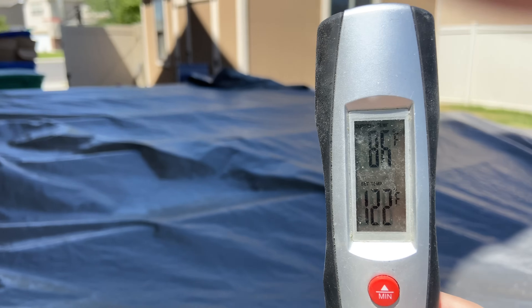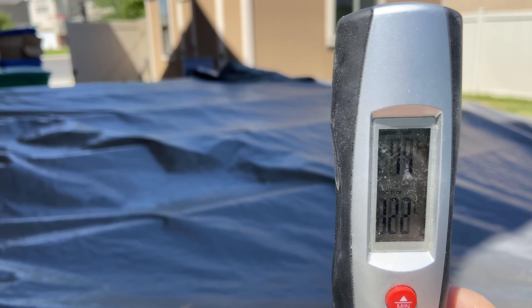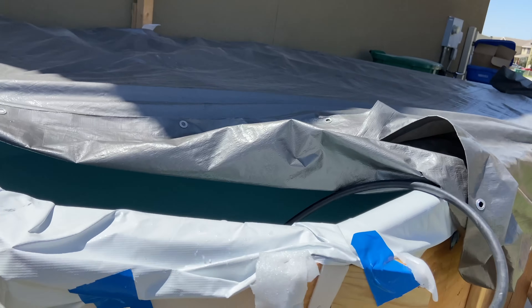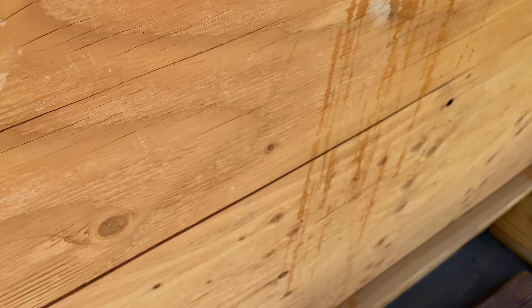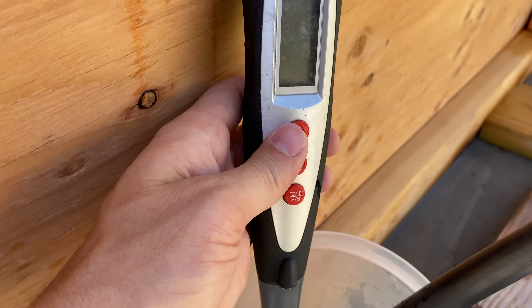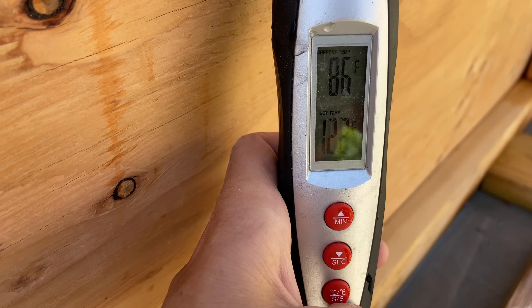Okay, this is our final test here. I'm going to place the thermometer in — the inflow hasn't dropped below 77°F, so that is the temperature of the water coming in. Coming over to do our last test on the outflow — I'll pull the outflow, stick it in the bucket, fill it up, and grab a temperature reading. This is just how hot the heater is working — true test here. We are at 84 to 86°F on the outflow.